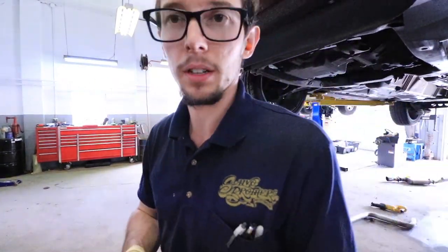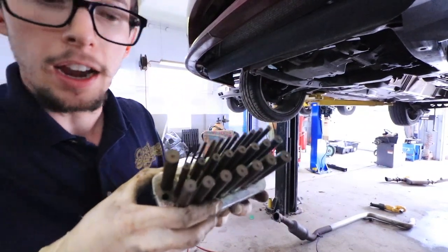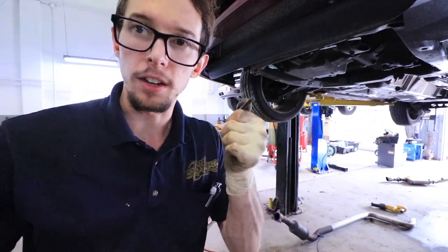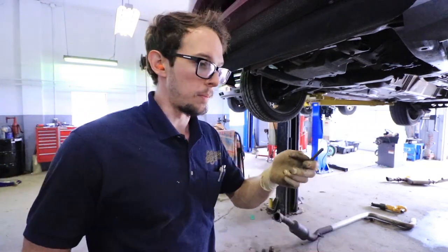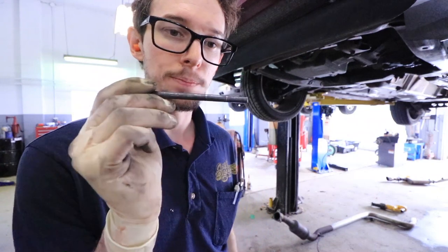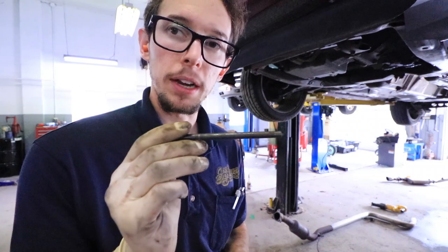So basically, I know I've showed this in other videos — it is an assortment of center punches, different sizes, and they have a punch in the middle of each one of these. You pick the size that's right before the hole that you're punching, then you smack it on there and get a nice center hole to drill properly. My only problem is the stud is not deep-set enough to actually get this in the hole to make it center. So what I'm doing is putting the back side of it in the hole and basically just taking a metal image of what it looks like there, so when I turn it around I can make it look identical and hopefully hammer and get it in the center.